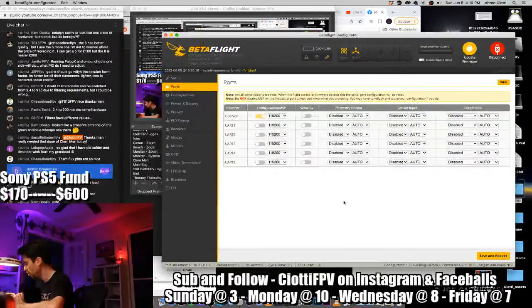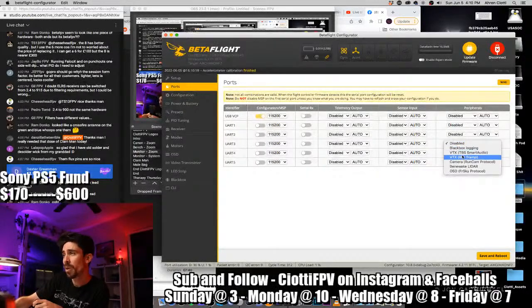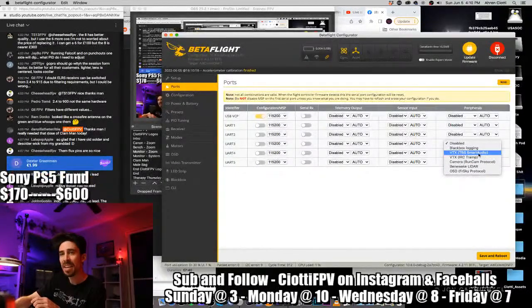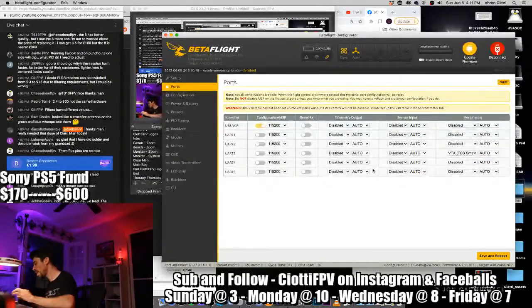I need to see what UARTs I put stuff on. So let's take a quick look. I've got Smart Audio on T3. So we're gonna come down here to UART 3. Well, this has a Tiny Tank. Here's a challenge for you. Does the Tiny Tank use TBS Smart Audio or Tramp Smart Audio? Who's got the biggest brain in chat or the quickest Googling skills? I'm going to take a guess at TBS Smart Audio. So that's on UART 3.